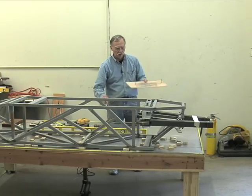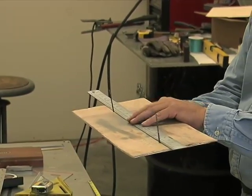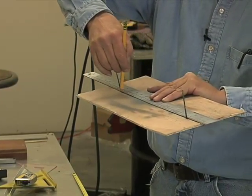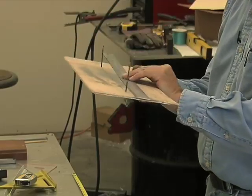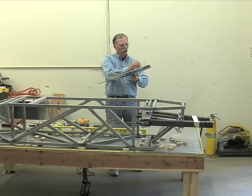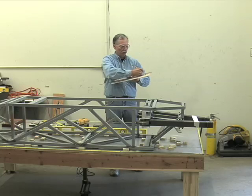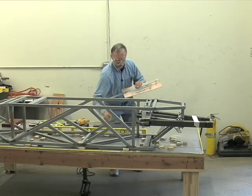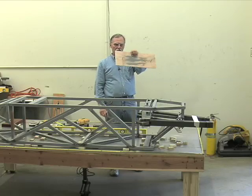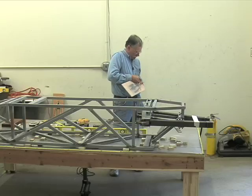Now, doesn't matter if it's an 8-foot table, 10-inch table, slide it up. Trace the line. Absolutely perfect every time. And if you size small drill bits, the line will come out, because of the standoff of a pencil or a scribe. A scribe is just a sharp point. It'll just drag a line in the metal. It will come out dead center on the hole. Doesn't get any better than that. I don't know if you can see it, but the line lines up perfect on the hole.